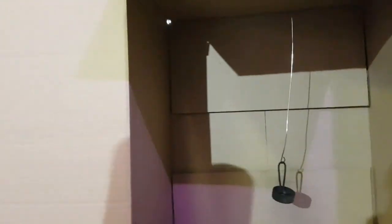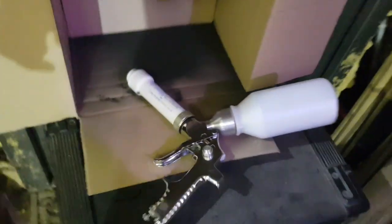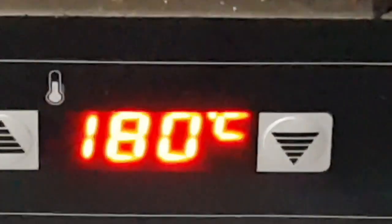Right, I think that's a sort of coverage - I'm going to turn it round and do the other side. There's a lot of powder down there. Now I'm going to take this mask off. Right - it is in the oven. It doesn't look like it's that well coated on some of the inside, but you can see it is coated on the outside. In there, and 10 minutes at 180.